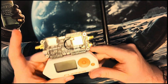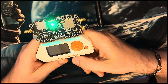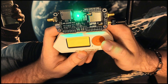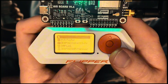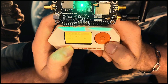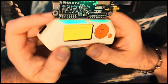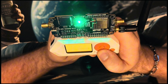Screw in the antenna — it looks quite neat. Next, turn on your Flipper. Press the side button, go to GPIO. After you go into GPIO, you'll see the USB/UART bridge option. You can use that if you have a USB-C connection, but we're not doing that today. We're going straight to the UART terminal — if you have Unleashed, it'll be near the bottom.